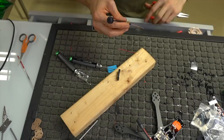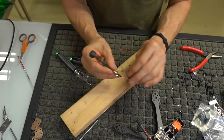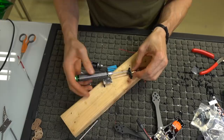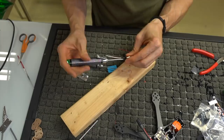And yeah, so now we're looking at this. We got the Triumph Pro right there, and we got our 5-volt Unify right here. What we're gonna do is take this guy, it's got a little hole right here, and we're gonna put that over the backside of the antenna, and we're gonna use two little 6mm aluminum screws here, and run them through the backside of this mount. And that's gonna screw directly into the little pigtail that comes with the Unify. And this is gonna make life super, super easy.